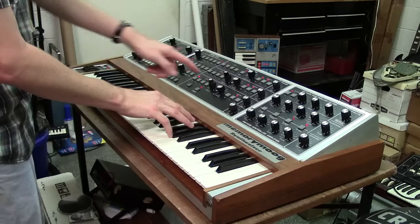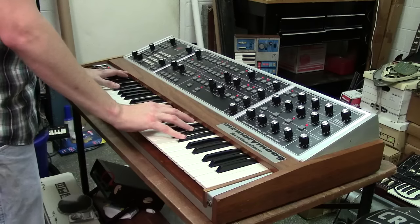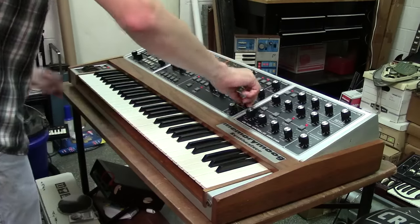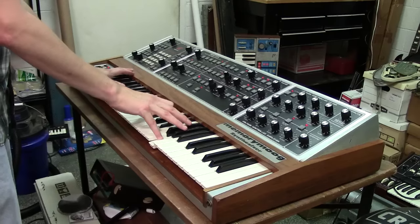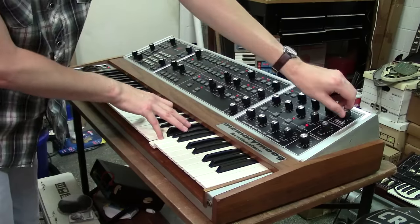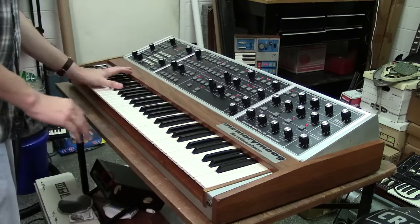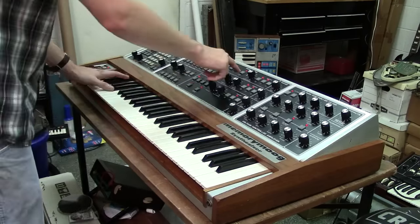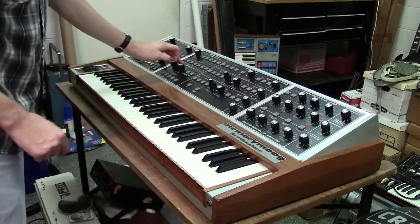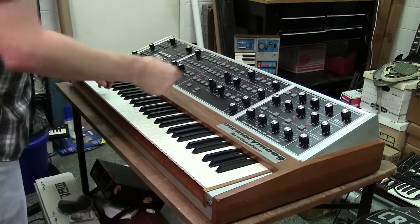That sample and hold, it's changing the pulse width of your oscillator. It's actually oscillator 2. And also what it's got too. Actually, I take that back. That's actually changing the frequency, and it's synced to oscillator 1. If we turn that off, you'll hear oscillator 2's frequency.